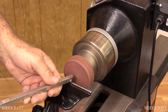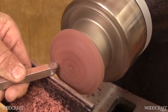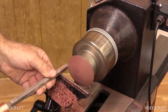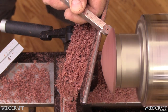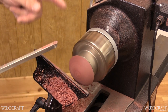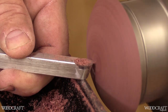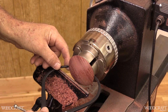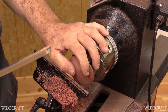Now I have my thickness set. I'm just going to take this face down, then set my calipers to two and three quarters for the diameter. I'm going to finish this curve and go right down to the point. I like the easy reach jaws because they keep my tool away from the chuck so I can come past with no danger of hitting. Looking sideways to make sure I have a nice graceful curve. Let's check the diameter with calipers — right on. No reason for sanding at this stage; we'll do that after we do our inlay.